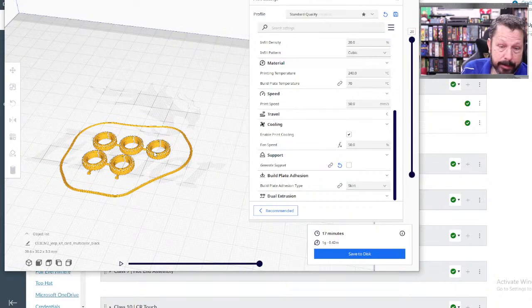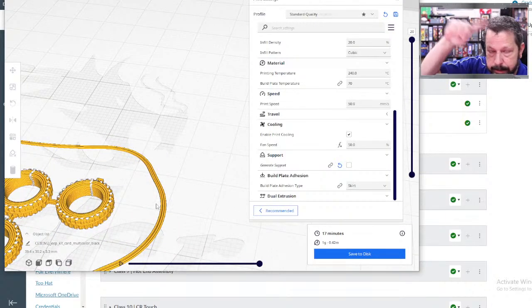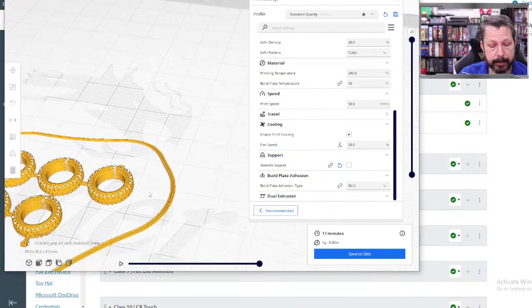That's not as common, but the other thing it does is it gives you, like, this is set to 3 layers. I don't know if you can see, 3 rounds around it, like little tracks around it. And so it gives you those 3 tracks around there to manually adjust the knobs on your printer while it's going. So while it's printing, you can go in there and say, oh, it's too close on that corner, so you tighten that knob down. Or it's too far away on that corner, so you loosen that knob to get the bed higher. So that's one way, and I do use that.